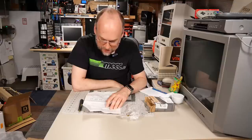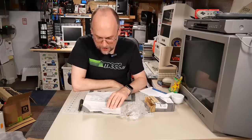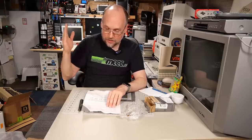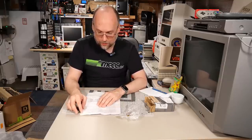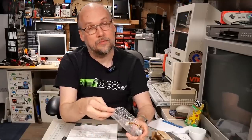The smaller version of this adapter is intended for direct attachment to the rear of the floppy drive. It can make a standard PC floppy drive work on an Amiga computer as a double density drive. The device will work with any classic Amiga — 500, 1000, 600, 1200, 2000, 4000, 3000, basically everything. Most game and demo discs will work fine with no special software or drivers required. I didn't even know you could do this outside of the disk drive.